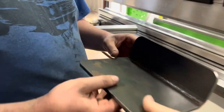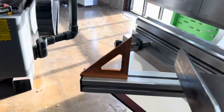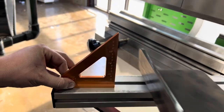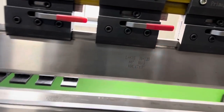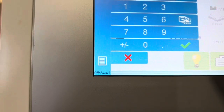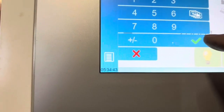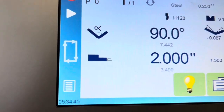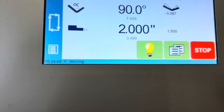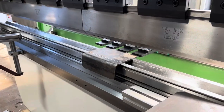Check the angle — it's probably a little bit open, so we'll apply a correction. You always correct your bends right here beside the angle setting. Enter the measured angle — I'm going to say 98 degrees, just a calibrated eyeball — so we have a correction entered. Hit start to make the change.